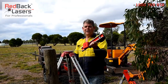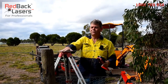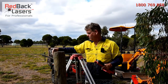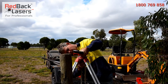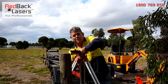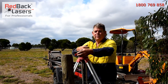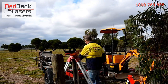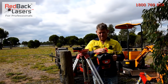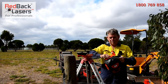Now we're going to take our laser offset bracket and put it onto our staff or onto our tripod. You can see we've located our tripod as close as we comfortably can to what is going to be our end post, because we're running our fence off here. We just fix that on and tighten it as tight as we can — that now gives us the ability to shift our laser into our perfect position. Grabbing our laser and our scope mount bracket, that scope mount bracket gets bolted onto our bottom laser mount.